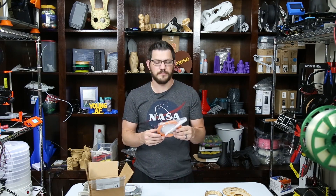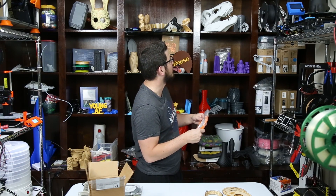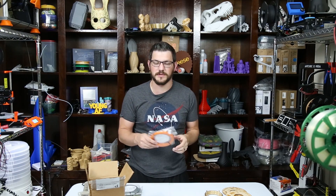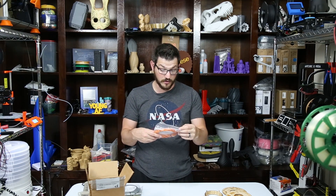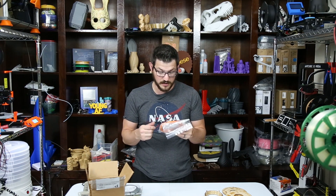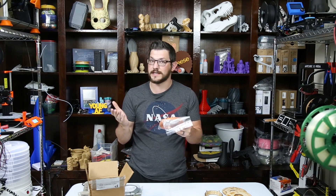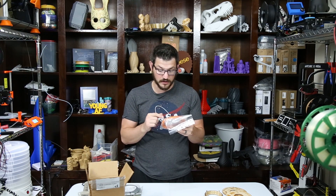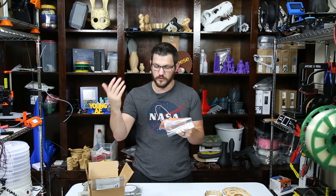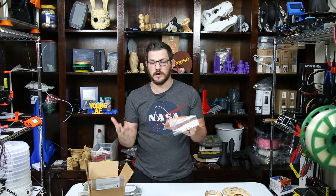Next is Coex's Limited Edition Pumpkin Orange PLA. I actually just got a shipment from Coex to do a full review, so this will help me gauge how their filaments perform. It's made using prime virgin resin colorants and processing additives, extrudes smoothly and consistently, and is made in the USA. Print specs: 300mm/s print speed, 215–235°C extruder (a little higher than general PLA), 0–60°C bed, non-abrasive.